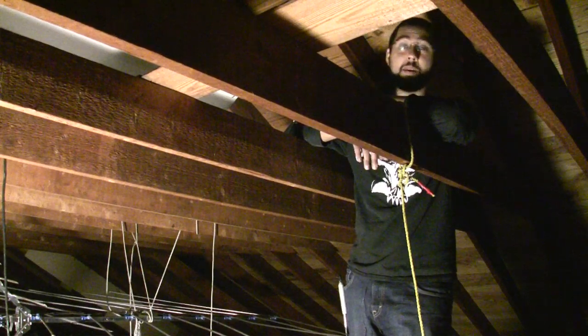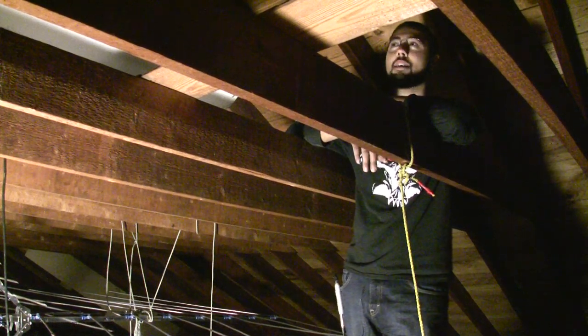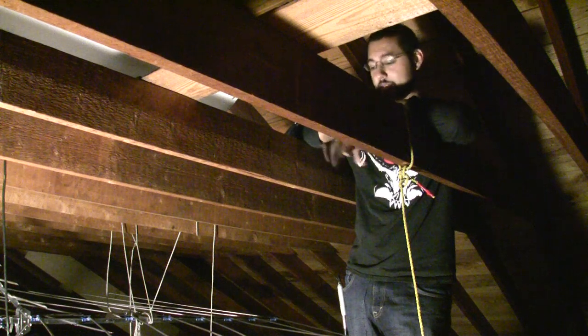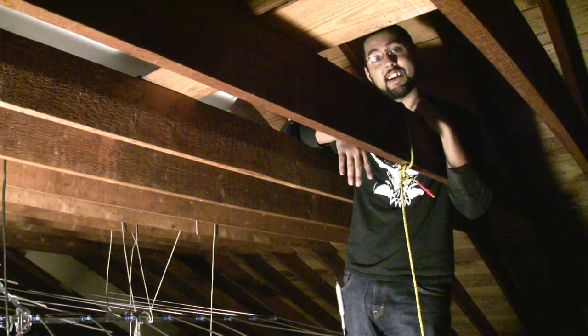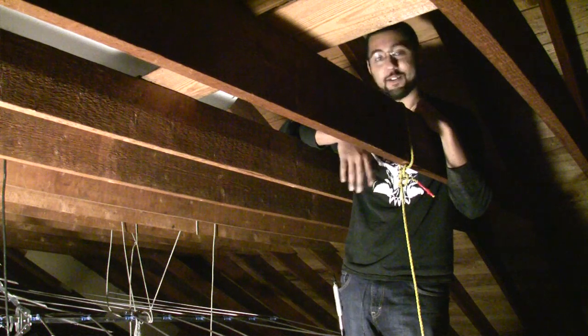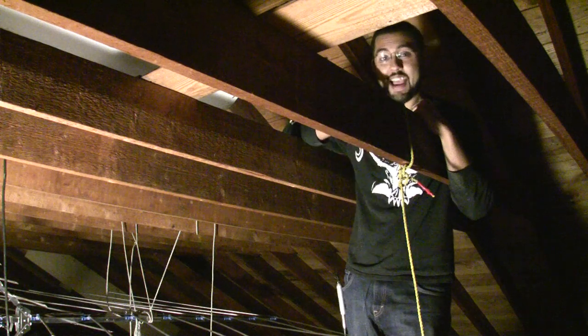If you were paying attention, you noticed I have a one-by-three splitter. Why three outputs when the HD HomeRun only has two inputs? Because I got greedy — if you're going to record lots of shows and you're getting 30 channels, why not record three at a time? So we have that third cable hooked up to one of our USB TV tuners.